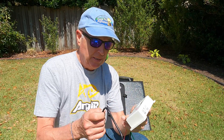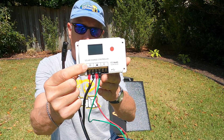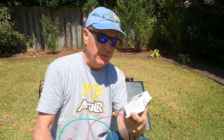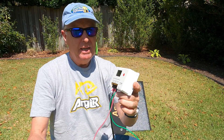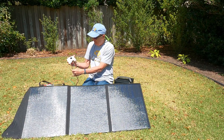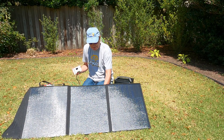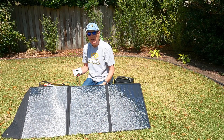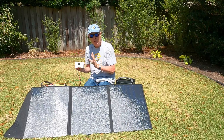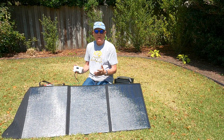Let's look at the solar controller setup. I had to get the DC-to-bare-wire connector, which goes into the port labeled 'solar panel.' I used 14-gauge wire — though 18 gauge works fine for 6 amps — connected to alligator clips on the terminal labeled 'battery.' For this test, my Bluetooth app shows the trolling motor battery is already at 100% charge, but the controller is showing 14.4 volts of input, confirming it's working as expected with the lithium-ion battery setting.